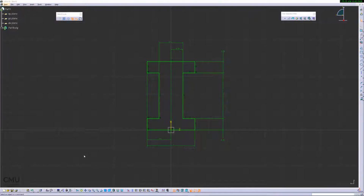This is chapter 5, self weight case. In this case, we are going to make an I-beam, and without any extra load, its own weight will be the only load we're going to apply. We can clamp it on one side and make it a simple case, or we can clamp it on two sides but give it the freedom of deformation from its own weight. And we're going to use a slightly different clamp method. Instead of a whole face, we're going to use an edge for the clamping.